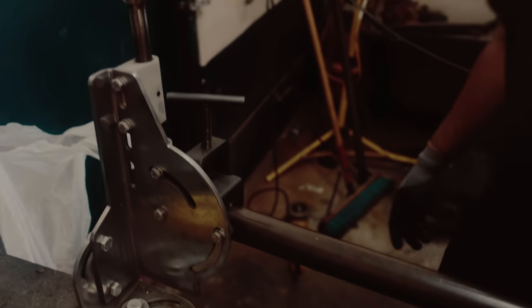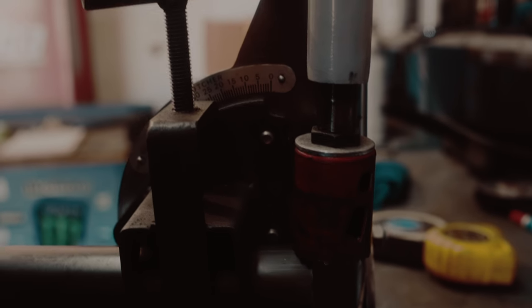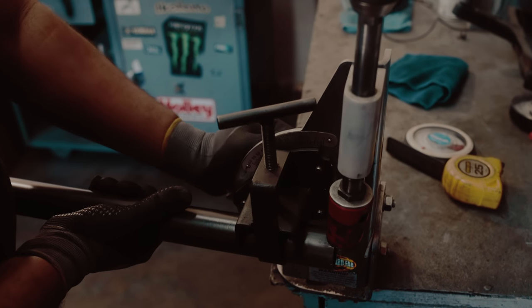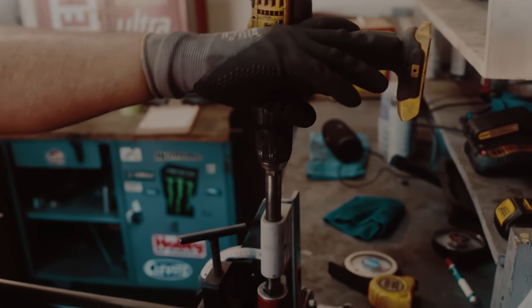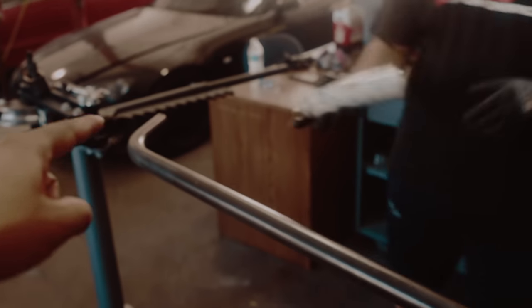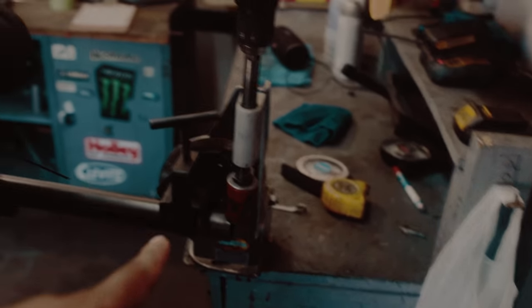All this is done out of the green, and on this side you see the number. There's three. Oh, so you're notching the pipe right now? Yeah. And so what you guys can see is that he has this pipe laying at zero degrees, so it's perfectly horizontal. And then he's cutting this pipe perfectly perpendicular on this side to notch it with the crossbar.